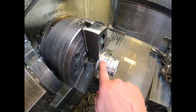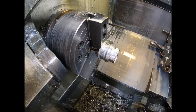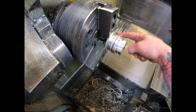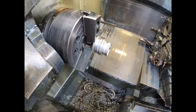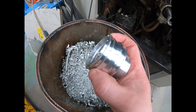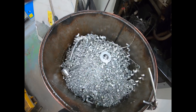Nice finish there. What we do is we leave it on here because if you've got a collet chuck and it parts off, it tends to drop. On this three-jaw it tends to whack around and the jaws can hit the part — we had a couple where it dinged the profile and then made them scrap. This one here, you can see it hit there quite badly and then really bad, so that's scrap.